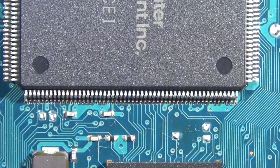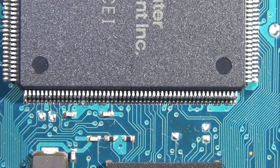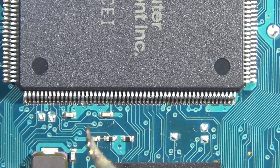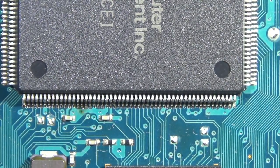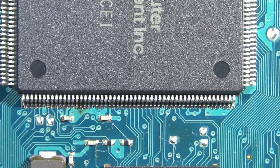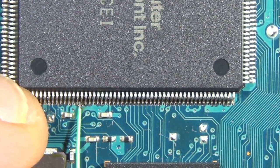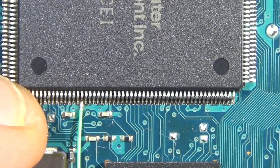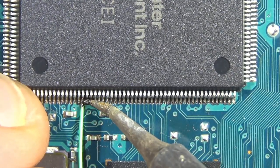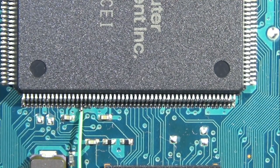Bonus strats. Shoutout to this guy — I'll leave a link to his channel. This is how he does the 90Ks and solders to them, and this is so much easier. It doesn't look quite as nice, but it looks plenty nice and it's about 20 times easier and faster to do. We're just soldering to the base of the pin — pre-tin it, rest the wire on top, press it down, call it a day. It's still a little slippy because it's going on top of the pin, but boom — easy, soldered, done, good to go.